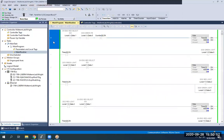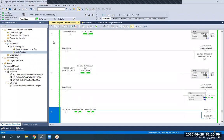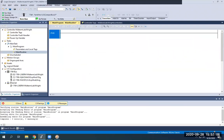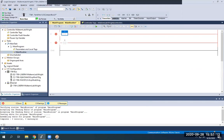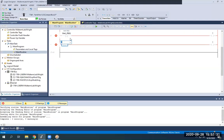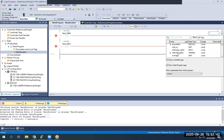The program has successfully taken. I've got it on the HMI panel to my left, I'm in run mode on my HMI, and my buttons are working. Now just to show you something — in your main routine I'm going to delete all these rungs because this is an old existing program. I'm going to make a really simple basic program. I'll add two rungs, throw a couple of XIC contacts in, and a couple of output energized coils. I'm going to make this start push button 0 and start push button 1 — copy this address and change that zero to one.